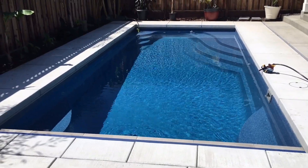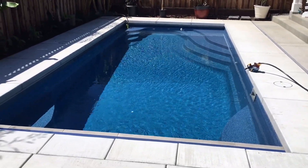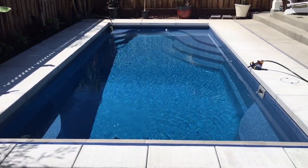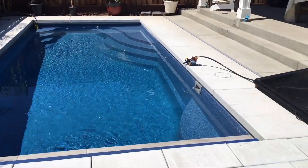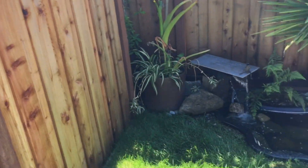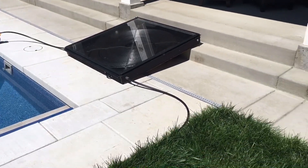During the summer I'll probably use the gas heater to maintain temperature if I don't use my solar system. But last year during construction, I had the cover on the pool most of the time and with outside temperatures of 85 to 90 degrees, the pool was 94 to 95 degrees every day. So at this point I don't think I'll have to heat it up at all during summer — I'll probably actually have to put a fountain on it to cool it down. The system starts over there, runs along the fence into the solar collector on the roof, back down into my new box, and out into the swimming pool.